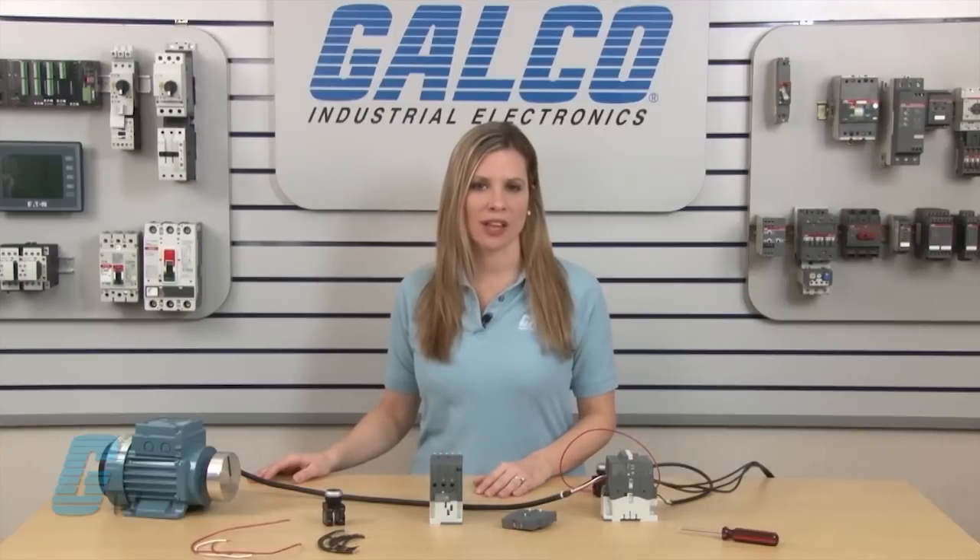I will now remove the control power and let the motor reach a stop. I will also shut off power from the circuit breaker further up the line from the contactor so that there is no live power to the contactor. To make a reversing contactor, I will need the same type of model contactor and an interlock device.